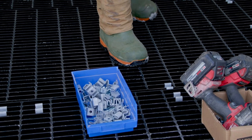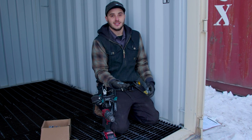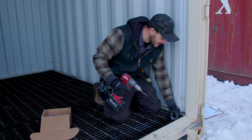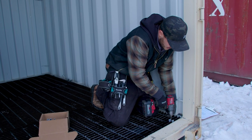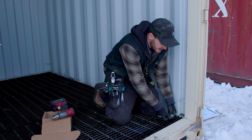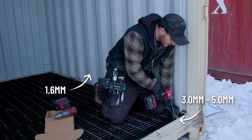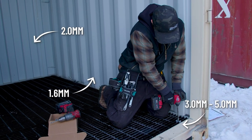The final step here to putting the flooring in is these Hilti Clips. We use them with a longer self-tapping three-eighths hex head-driven — it's a quarter-inch self-tapping screw. We do like to pre-drill a lot of these; you use two self-tappers to get one hole. This footer material here — I think it's three or five millimeters thick — it's a lot thicker than the sidewall corrugation, which is only 1.6 mm thick. Sometimes the end walls are two millimeters. Interesting fact.